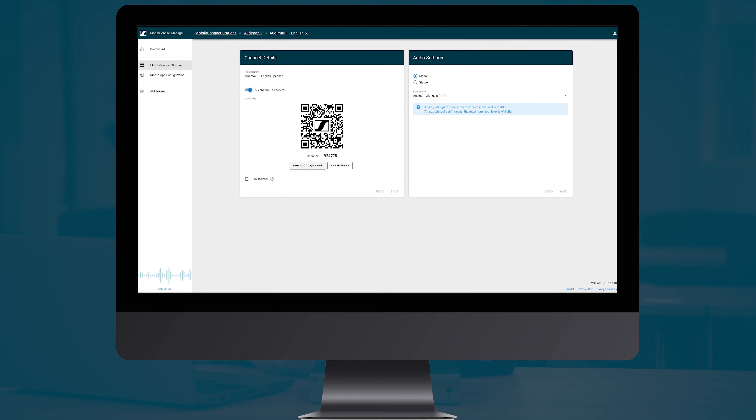Because we're talking about audio over Wi-Fi, we want to make sure that privacy is appropriately addressed. You can use the manager to set streams to only have access via a QR code, which means the users have to scan the code before gaining access to the audio — they need to be in the room. Taking this a step further, you can utilize the Mobile Connect API to instruct a QR code to regenerate, even on a schedule if you're using a DSP, so that only the people in the room at that time have access to the audio feed.